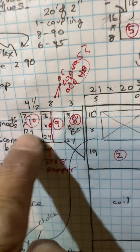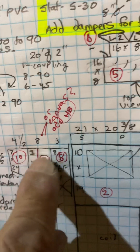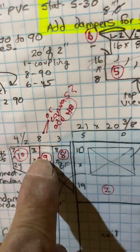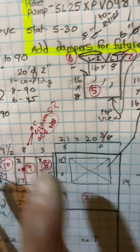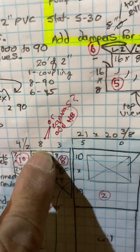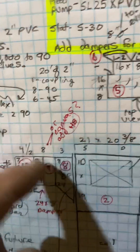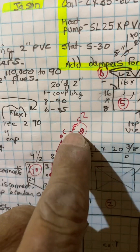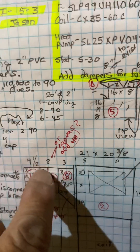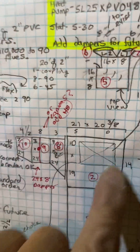I did not give you a canvas on this — this is actually a straight piece of duct, but I'm going to give you a canvas as well. If for some reason you can't get this to work without a canvas, you can put the damper inside a canvas — I made the canvas the same size as the damper duct. So you can put a canvas in place of duct piece number nine and then put a flat piece of metal on the front where the damper comes out. But if you can do it all from inside, that'd be great.